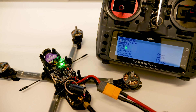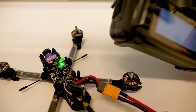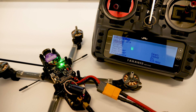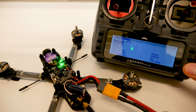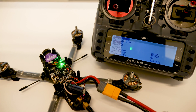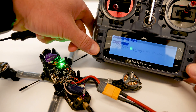This particular model has already been bound, so you'll notice the green light is solid here and also solid on the back of the Crossfire transmitter. However, in the scenario we've laid out, yours would not be solid — it would be red. All you need to do is press the bind button once. Apply power, press the bind button once, the bind light will start blinking slowly green, then come over here and press Enter on 'Binding.' It will start binding and the light will go solid green, indicating the bind was successful.